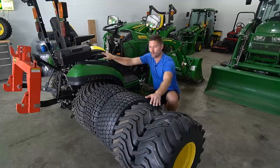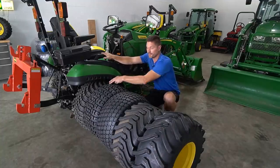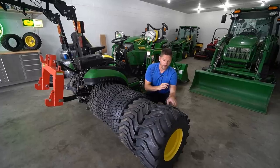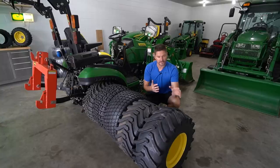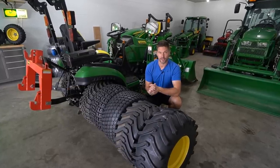Really beyond that, I'm gonna go ahead and shuffle these three right here in the middle, in no particular order, and then I'm gonna give the radial here the edge for the absolute best tire that you can get for paved surfaces. The reason the R1 here is really bad is not that it doesn't have traction or grip, but it is a little bit bumpier of a ride just based on the construction of it, and it's also gonna wear very, very quickly on those paved surfaces.